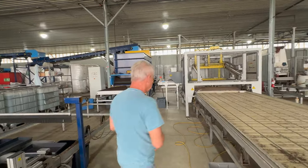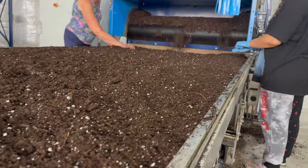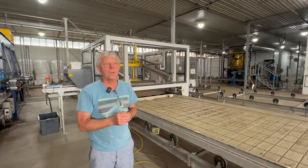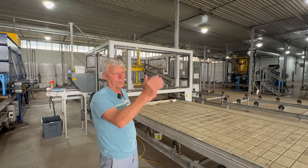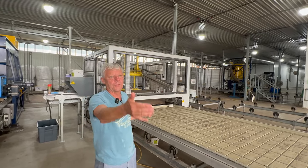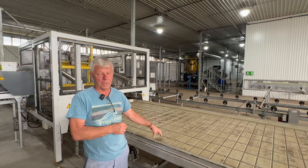These tables are five by 19 feet. Standard table size depends on the greenhouse width — most Dutch greenhouses are 21 feet wide, so the table is 19 to leave a two-foot walkway at each end. These are flood tables that were designed to handle pot culture — potted mums, African violets, and so on. The reason I bought this facility is that it had the entire table system. The facility was very tired, so we replaced the roof and the hydronic heating system, but the value of the tables and table handling system made the purchase price make complete sense.